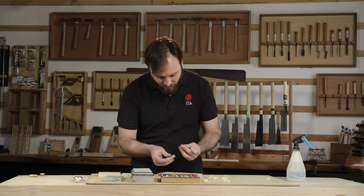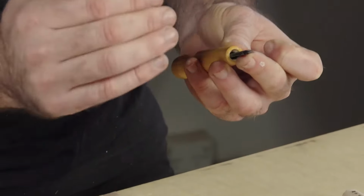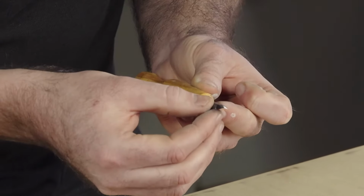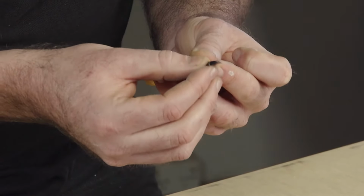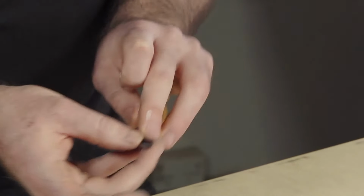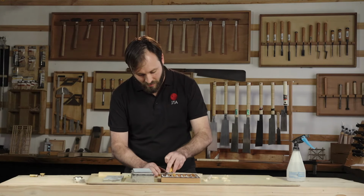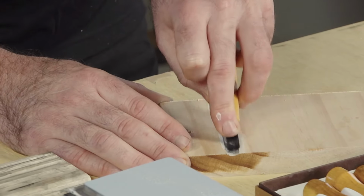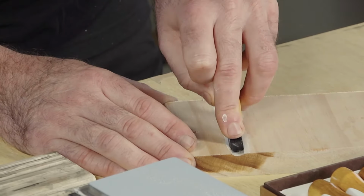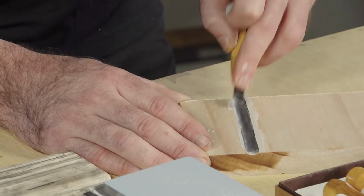As I inspect my edge, what I'm looking for is to see if there's any flat spots that are going to keep the light. I want the light to roll off my edge all at once. I've got probably a little flat spot in each corner, so I'm just going to keep working those. Giving it 5 minutes of stropping on the timber with some Waterstone grit is a great way to keep your edge nice and sharp, nice and maintained, without altering its geometry.